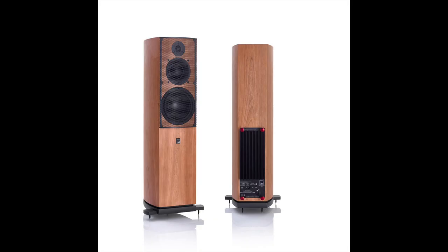So that really comes from my background, hanging around in recording studios. I was always drawn to big studio monitors just for their full scale and openness. And so many of them had the 3-inch dome, of course, pioneered by ATC way back in the 70s. And these days, produced by Volt, they do a few different versions, but there's just something about that 3-inch dome: low distortion, low moving mass, but high power handling and good dispersion, obviously, being a dome. So that's the natural choice there.